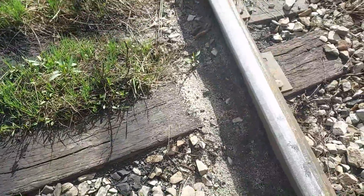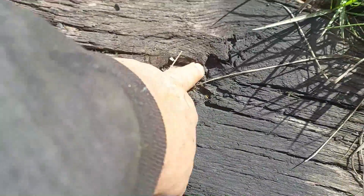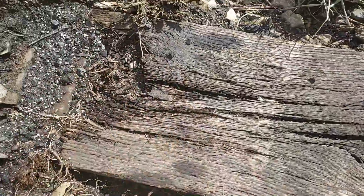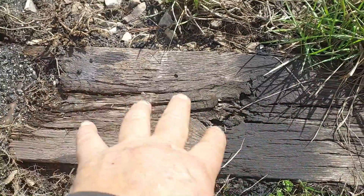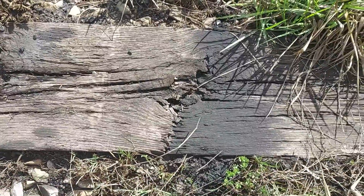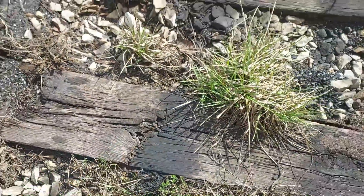Here's one of the things we look for in a tie. See how this tie is all split here? Like that — we've got some splits in here, and over here even more. That's one of the things that I look for. What happens is, when that tie goes like that, the water is going to start to drain down inside the tie, and the longer it's left like that, the more the water is going to get down in there and the more it's going to rot. So that's one thing we look for.